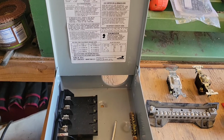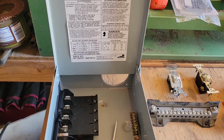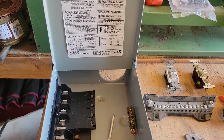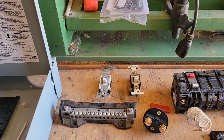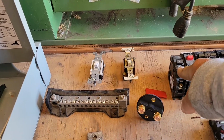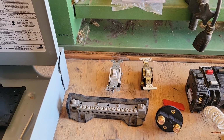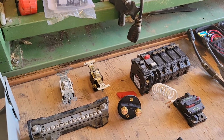So anyway, if you're using 14 gauge wire in household, in residential, you can use a 15 amp breaker, because the 14 gauge wire is rated for up to 15 amps of usage. And what makes a breaker pop off when it pops in your unit is heat. So the heat is fed back through the wire, and then inside of here there's a little spring and a little sensor that picks up that heat, and then it'll cause this thing to pop and open up, so you're not feeding electricity to that circuit anymore. Because if you're overheating the wire, that means there's something wrong with that circuit.